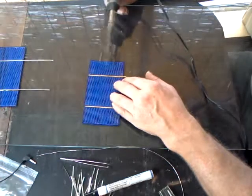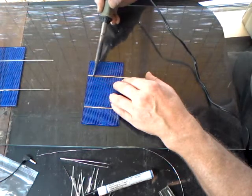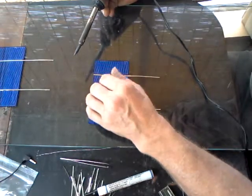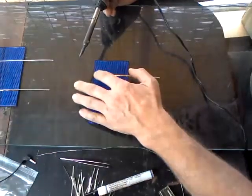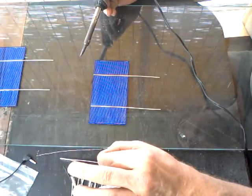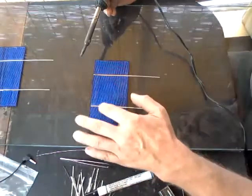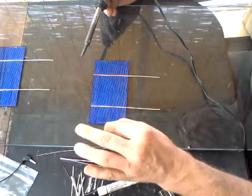There's something you want to be aware of: every once in a while you'll have a small ridge or bump on your soldering joints — you don't want that, that's a cold joint. With these panels, any little ridge, bump, or sharp point on the solder joints will poke through the encapsulation we'll be doing later. It also creates a pressure point that can fracture the cell.